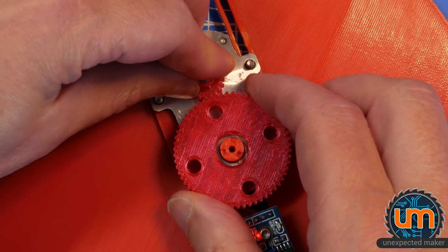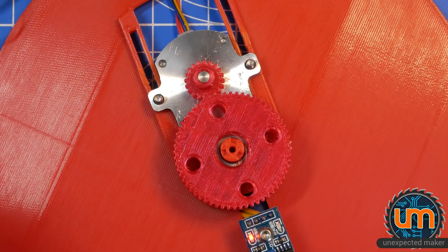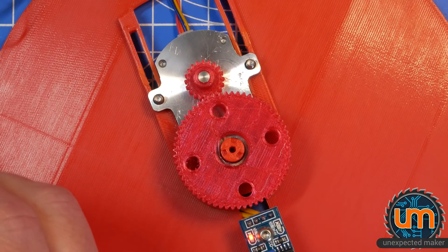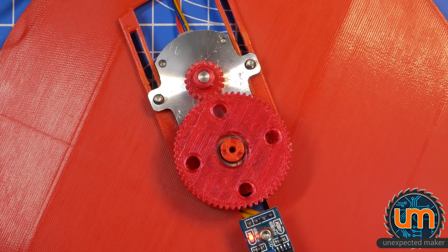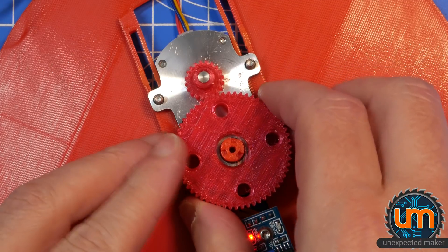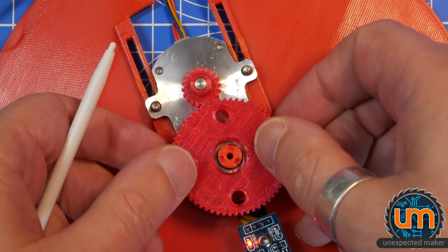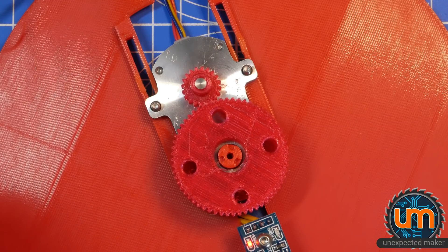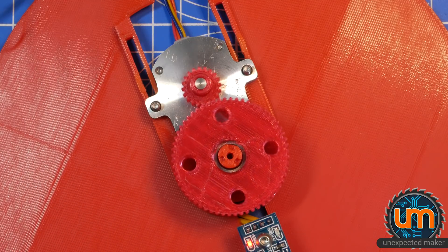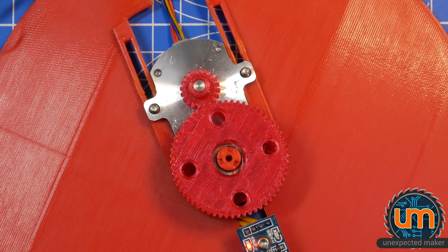There's no slippage - I can't rotate and slip it. I think overall it's noisier for sure. You can hear the rattling. There's just a sound to do with the rotating of the cogs, and it could be the cogs are touching a little bit. I might have to reprint this one to make it a little bit thinner. I can't say I'm a fan of the noise but I don't really know what else to do. This is a little bit warm as well - I'm not sure why. Maybe I played around with the current again and got it too high.